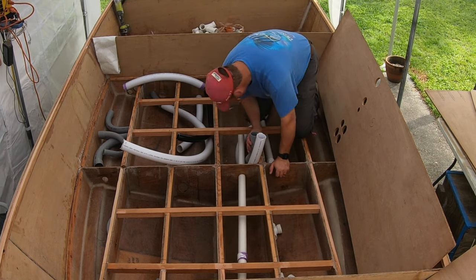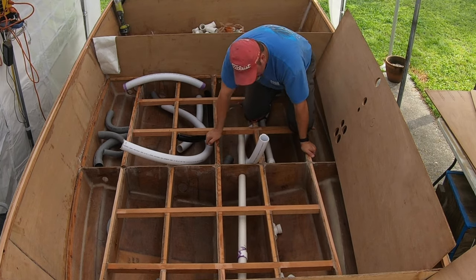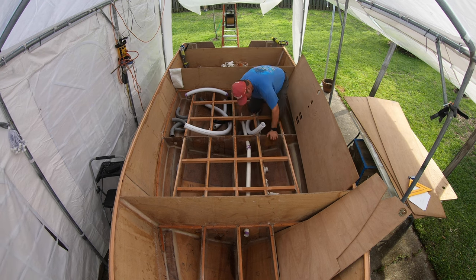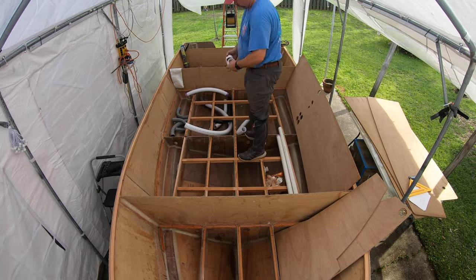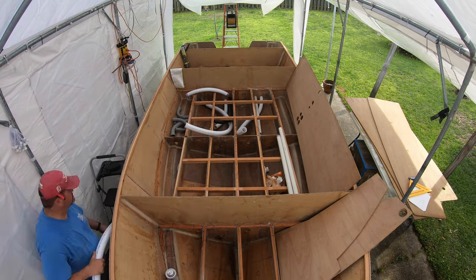This is that additional 2-inch chase, and I'm just trying to get an image here of what it's going to look like coming up through there. And watch here. This is where I learned about those DWV fittings. I just moved that pipe a little bit. But I can tell you, if you put Schedule 40 fittings on there, you can move that thing all over, and it's not going to come apart on you.